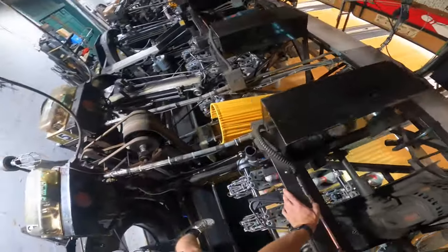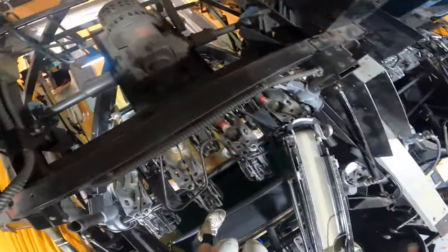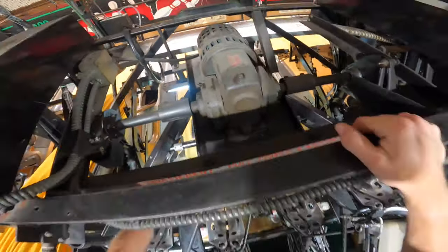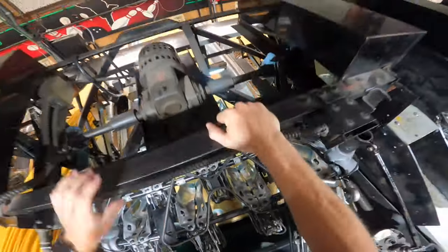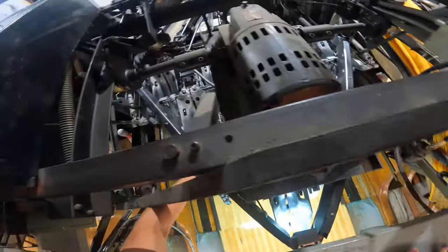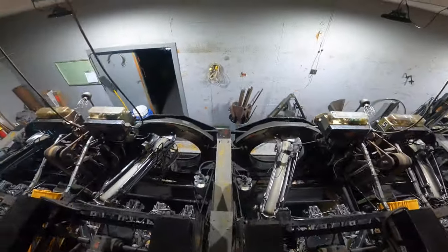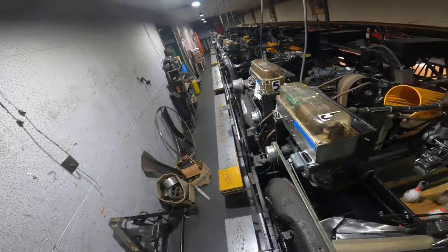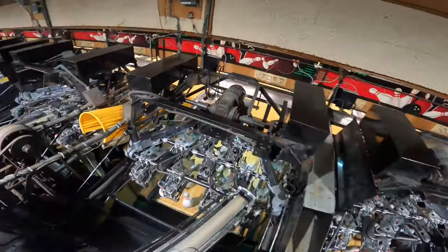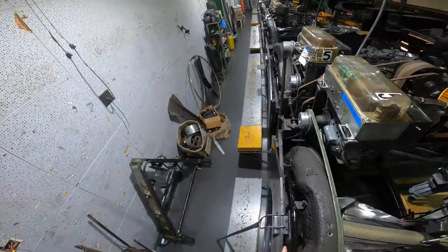We're going to do another five pin setup here. Basically just get the pins out of the cups like that. You might have to go up front to get the head pin, the two, and the three. Since we're already on second ball, hit the reset button. The only thing you have to do now is pull the cups back once it goes to spot, because the weight of the pins is what drops the cups. Grab a respot cell, pull it back as it spots, and then get it back on second ball.